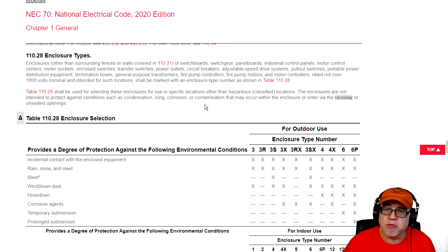We're talking about specific ratings — basically, what is the enclosure itself rated for? A typical panel that you would have in your house is going to be what's called a NEMA 1, and it's rated for incidental contact with enclosed equipment. It's going to have a dead front on it so that you can't just poke your finger in there. No big openings on it. Once it's completed and put in place, it's not easy for little Susie or little Johnny to come along and make incidental contact with the live parts inside this enclosure. That's inherent in all of these enclosures.